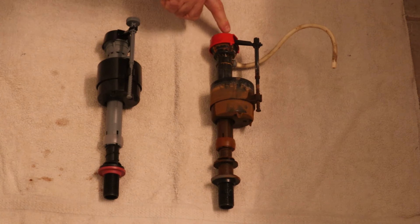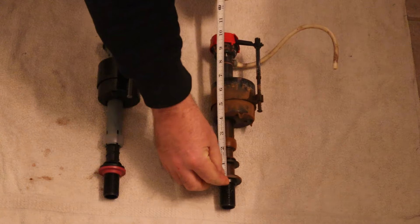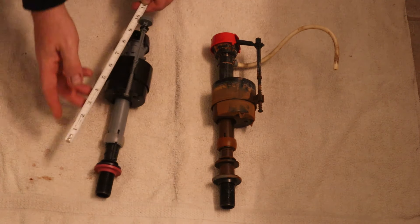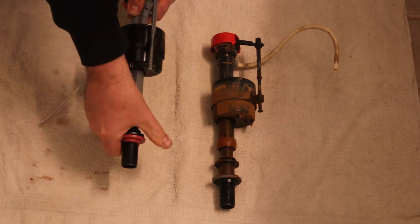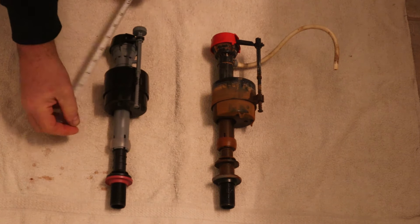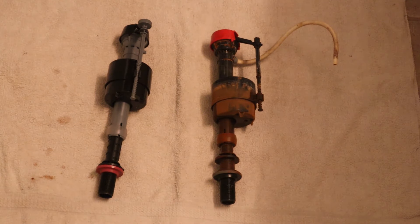This part needs to be about three inches above the overflow pipe, and this one was. I'm going to measure — it's about ten and three-quarter inches. I'll make sure the new valve is about the same. It needs to be a little bit bigger, so you just unscrew this a little bit. Now that's ten and three-quarters, so these should be just about the same when I install it into the tank.